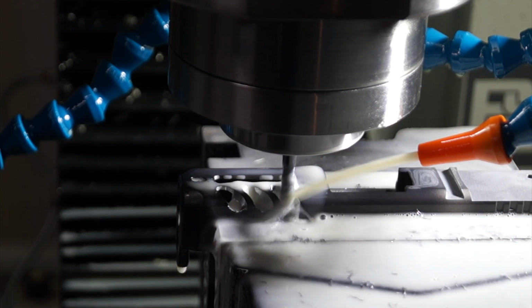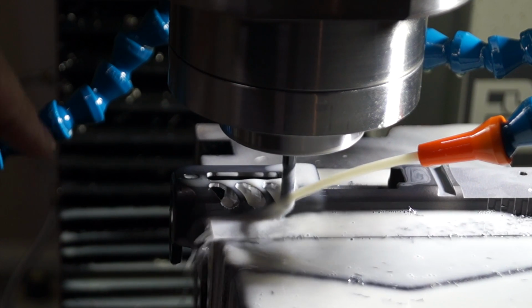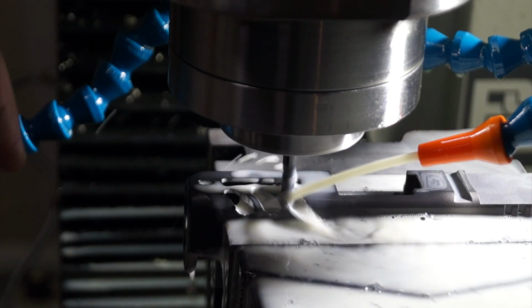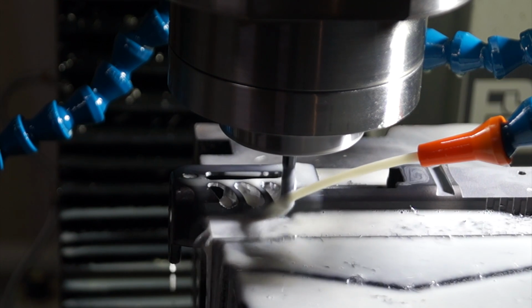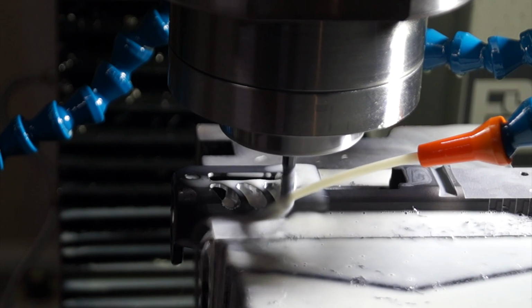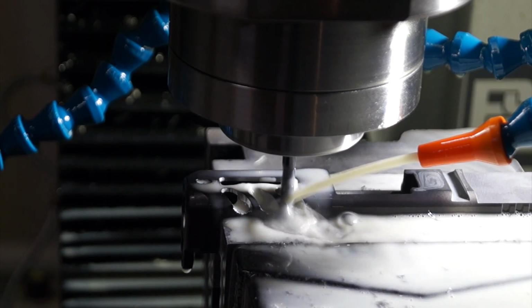Alright guys, so one of the reasons why it's so aggressive on the cutter is once it actually moves down into the inside and then plunges, it's only plunging on half of the tip of the cutter because we've passed the wall and we're into the inside where the barrel goes. So basically you're hearing that chatter because the bit is kind of just trying to find its center as it's going down. So it's a little aggressive on the cutter. We're going to toss that cutter when we're done with the project, but we should be able to make it through just fine.